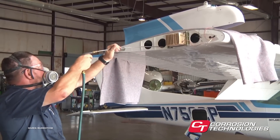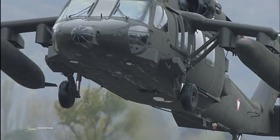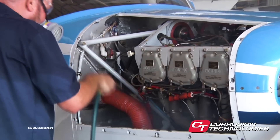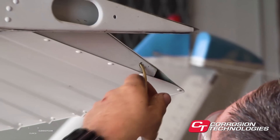If you were to buy a factory-built airplane, all of this is already done for you — they apply whatever chemicals or priming solution to protect the material before painting. But if you're building an airplane by yourself, in your garage, or with friends, this is a process you have to apply yourself. Primer is what you apply to the aircraft — mainly to the parts and the joints. For example, any time you have two pieces of metal, or in this case aluminum and fiberglass with the Sling TSI, whenever two parts come together you need to apply something there to protect against rust and corrosion.